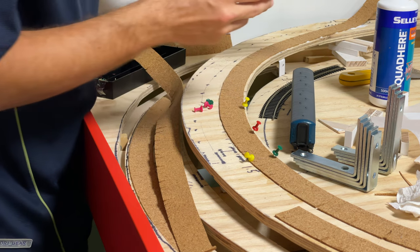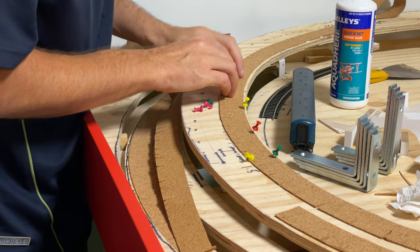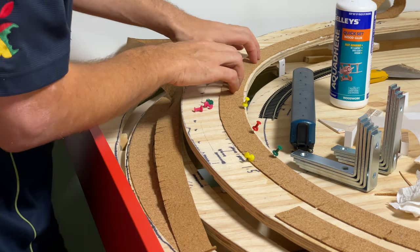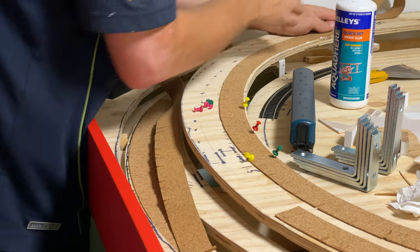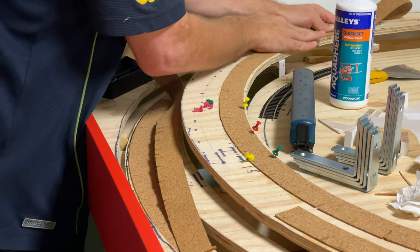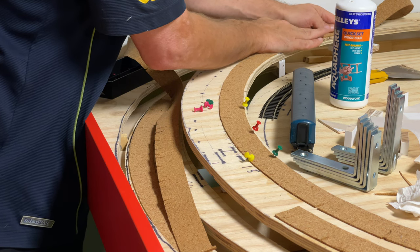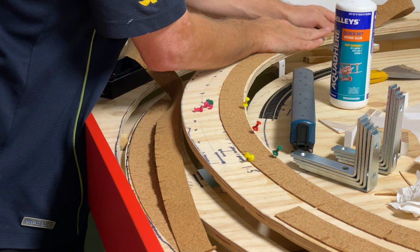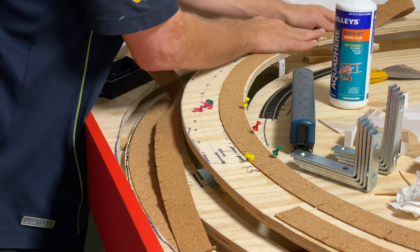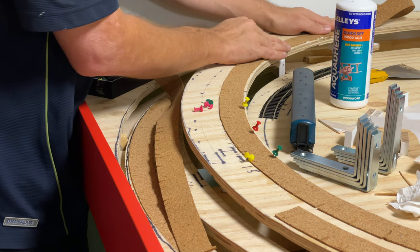And as this PVA glue starts to become a little more tacky as we're going down, it becomes a little more manageable to move. In fact, even within that first half an hour to an hour as you're doing this, if you need to quickly reposition something, it's a wonderful thing to do. Of course, the downside is it does take time to set. We sort of leave it overnight in general. I know the exact curing time is usually 24, 48 hours or what have you.